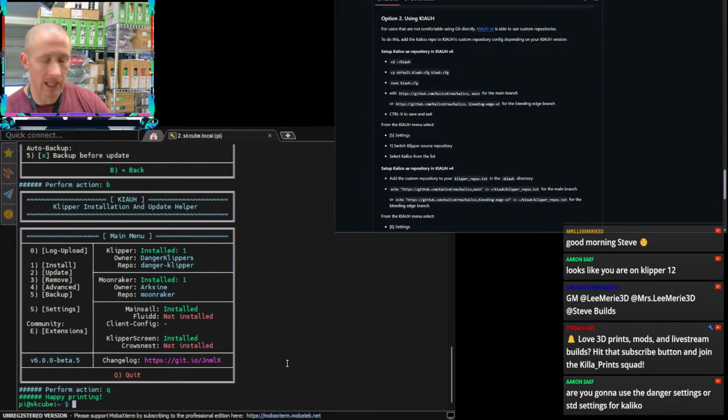I know for sure that I'm going to get rid of the closed loop stepper system on here and just use normal stepper stuff. I don't remember what model motors are on X and Y right now. I want to say they're 2 amp motors. But I have extra 2504s, and I may swap those motors out once we get into that. Again, today we're just going to try to get it back running and see how that goes, and then we'll talk about updates on the next installment.